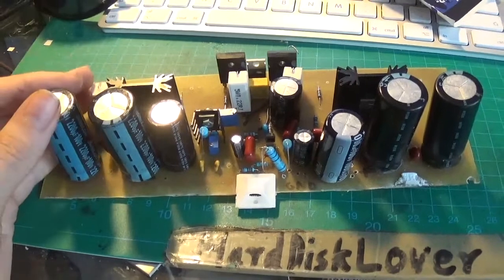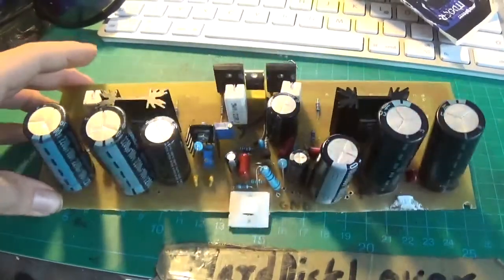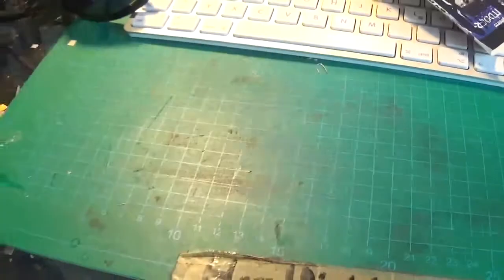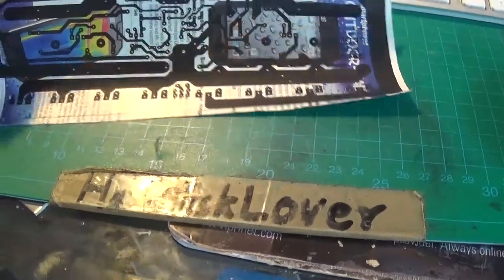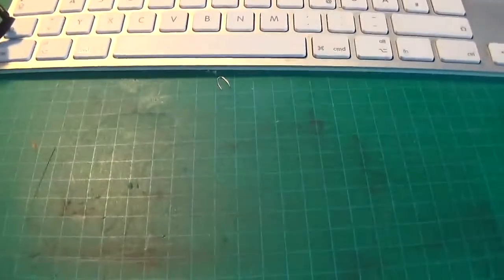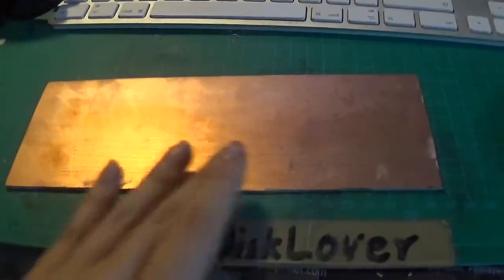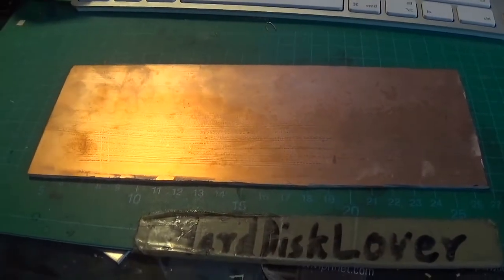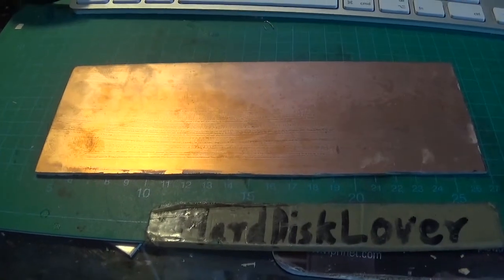What's wrong? I don't know — it sounds terrible and currently I'm not getting any audio out of it anymore. So I just thought, ah, forget it. What I did was I printed out the negative for the board. I hope that is the proper negative. And this is what will be transferred onto a PCB, which will then be etched until we have our proper traces. Pretty easy to do — I've got all the chemicals I need and it really is a pretty simple concept.